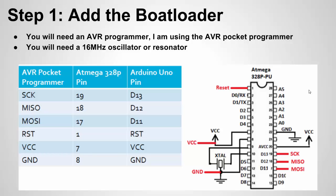When you buy the chip by itself, it will not have the bootloader on it, so what you need is an AVR programmer. AVR basically stands for the architecture family of the 328P from Atmel, and any AVR programmer should work. There are a bunch of different options out there. For this example, I'm going to be using the AVR Pocket Programmer. I believe I got it from SparkFun for about $15, and I had to install drivers, but SparkFun had instructions on how to do that.